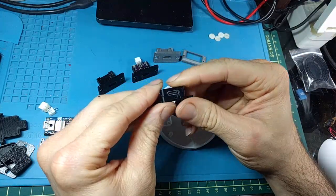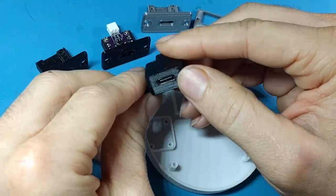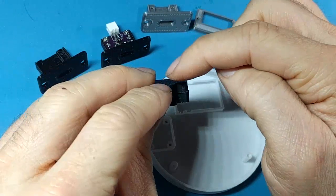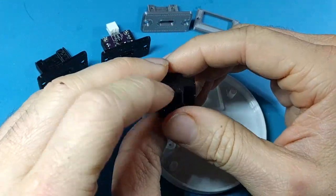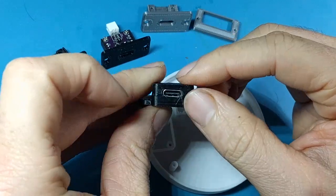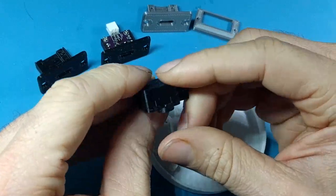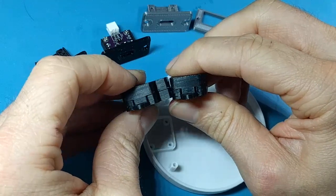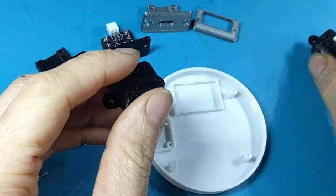I'm going to zoom in so you can see this a little better. This is an iteration on that design with a 90-degree USB-C connector, so if you don't want a plug going vertically up, it'll come out sideways — a little nicer for a more flush look. There are some marks from my X-Acto knife where I was trying to get a piece of plastic off, but that's not a big deal. I printed this one at 0.16 and I believe the other was 0.12 — they both turn out just fine. You can see the 0.16 has a little less gradation in the layer lines.